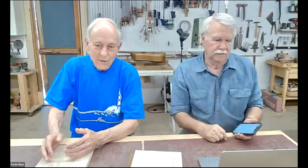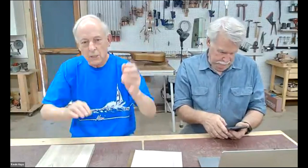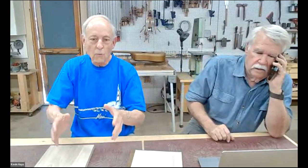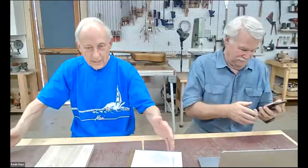Now, all these other companies have features like HEPA filters and mumbo jumbo and sweeping mechanisms that clean all. That all costs money. But the one you're looking at, Michelle, would be great. I've got a Jet one like that. You just hang it up and it works fine for my Agazzani bandsaw, my radial arm saw. It's 650 CFM. It's great. Don't try to hook that up to a big dual drum sanding machine. It won't work. It doesn't have enough cubic feet per minute of suction power.